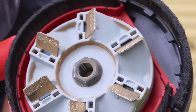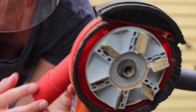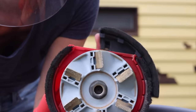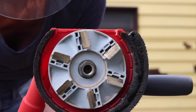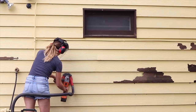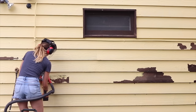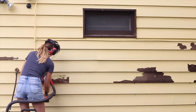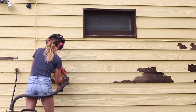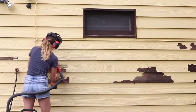First power tool is called the diamond brush. This has six blades that are diamond crusted and they spin around to basically cut the paint off. I have a dust shroud on here that I'm going to hook into a shop vac. My dust shroud has this movable top piece that allows it to have a straight top — it can get right underneath the lap of each piece of siding. It just attaches to a regular angle grinder, and mine's battery powered, but we quickly learned that you need a corded angle grinder for this job because the battery goes out so quick. The diamond brush is doing a very quick job of paint removal and it's also quite thorough. I was super impressed at first — I was thinking this is a solution, this is how we're going to get all the paint off.